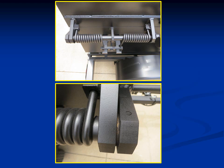And also, we look at the hinges. They're 1/2-inch thick hinges. And in between, if you can kind of peek in here, you can see that we have bushings. On all of the moving parts, we have bronze bushings with SAE 30 oil impregnated in the bushings. They're actually not bushings, they're sleeve bearings, rated for 4,000 RPMs. So they're smooth and very effective, and it just glides open. So it's a good, strong lifting mechanism, and one that would simply last a lifetime.